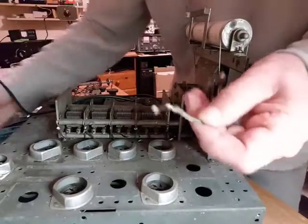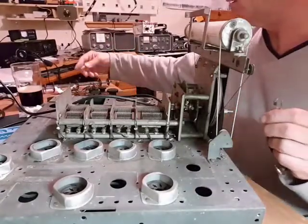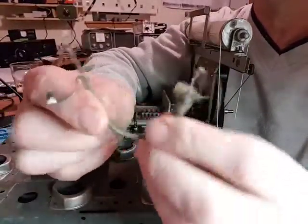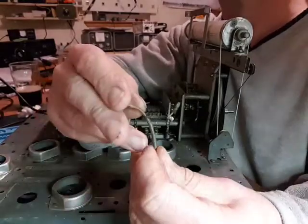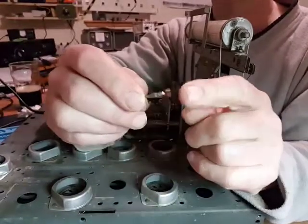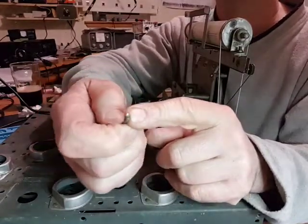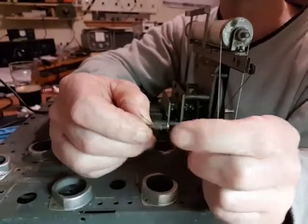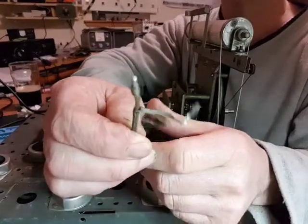So it can be done at 450 degrees. I've got another one here which is probably better. These are the top caps of the valves and they went to the capacitors. That's the earth side. This is like a little coil of wire around it like a strain gauge at the end - almost like a little spring. It's soldered onto the end - it's the center wrapped back around on itself with a strain relief. This had the rubber insulation over the top of it, so I never noticed that until I removed them.